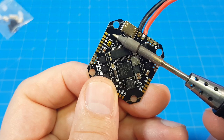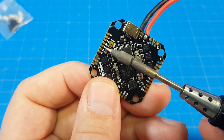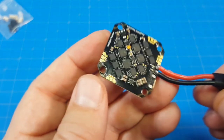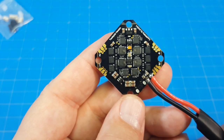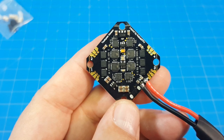I've rotated the board again — we've got TX1 right here, ground, five volt, video out, video in, five volt, and ground. Let's take a look at the other side of the board so you can see all the different components that make it up.